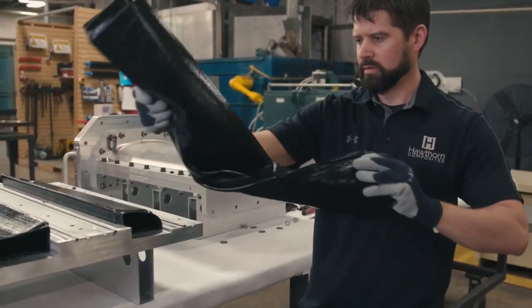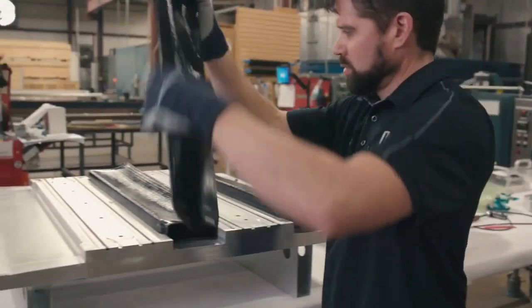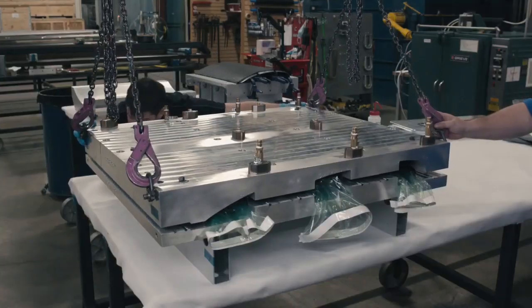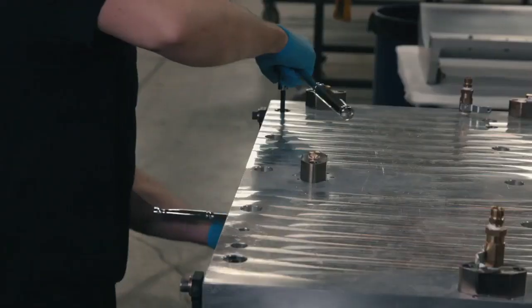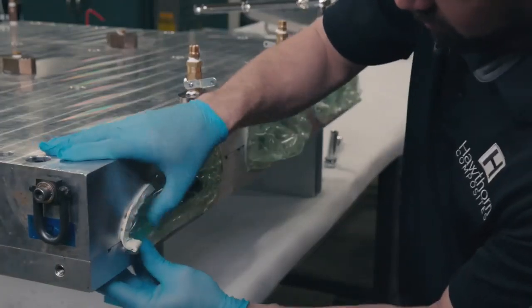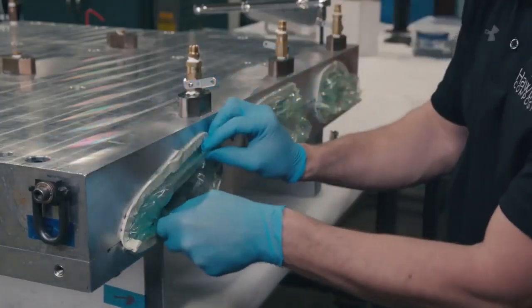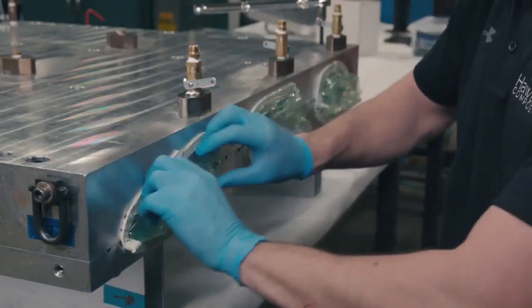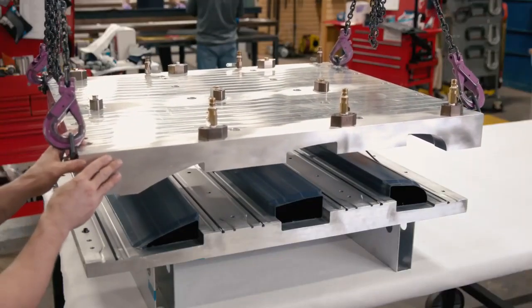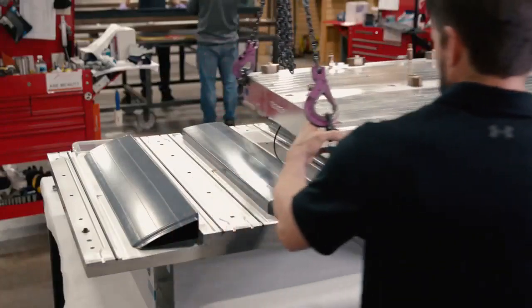After extraction, each smart tool is placed into the preheated reforming mold. The upper lid of the reforming mold is secured to the lower half with bolts. Vacuum bags are pulled through the smart tools and sealed to the mold, and vacuum is pulled to reset the geometry of the smart tools. Once cooled, the now rigid smart tools are ready to begin the next production cycle.